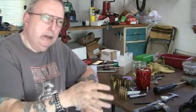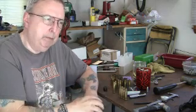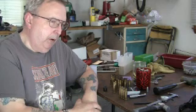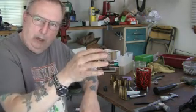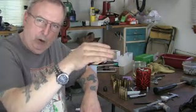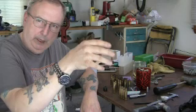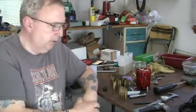It doesn't really matter, making an alloy harder or heat treating them. I know a lot of people do that, and I'm not saying it's wrong. I've done it in the past. But what's happening is you're getting the blow-by. The bullet's not expanding all the way. The gases are going up in the rifling and melting the bullet, and that's what's causing the leading. A harder alloy, it might not melt as easy. They all melt around the same temperature.